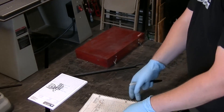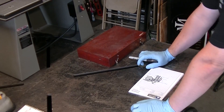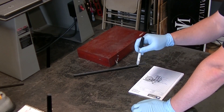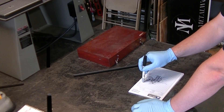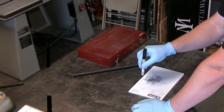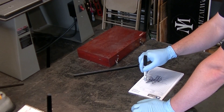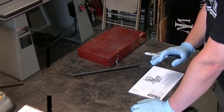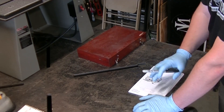I do a lot of stuff with CNC and I'm kind of spoiled in that my cutter has an electrical sensing capability. The plasma cutter comes down, touches off, and because it basically shorts the sensor it knows when it touches the material — so it knows where its start is and can automatically adjust. It goes up 0.15 inches for piercing and then automatically comes down to its cut height.